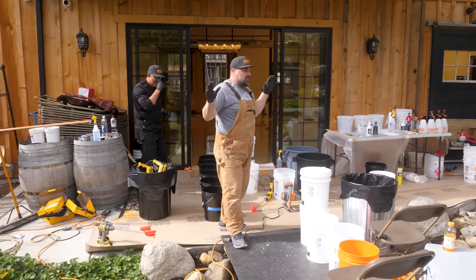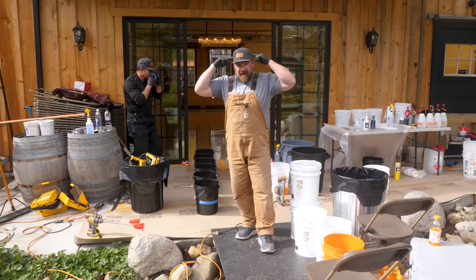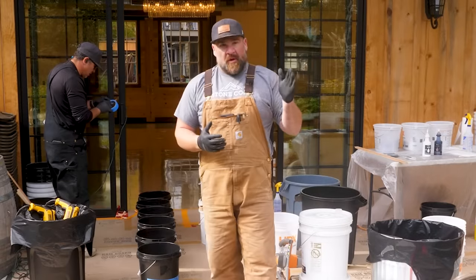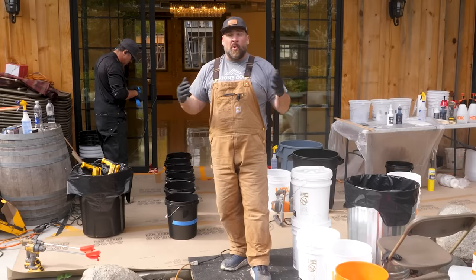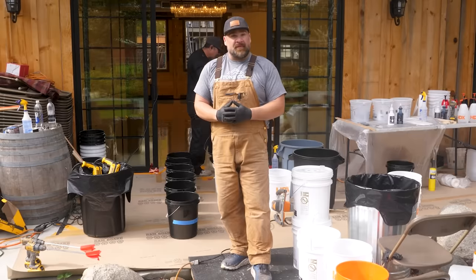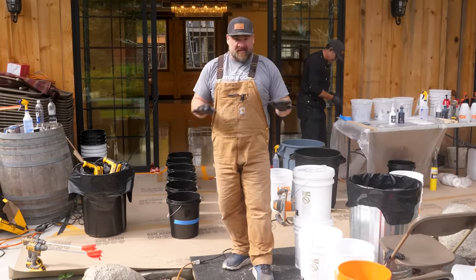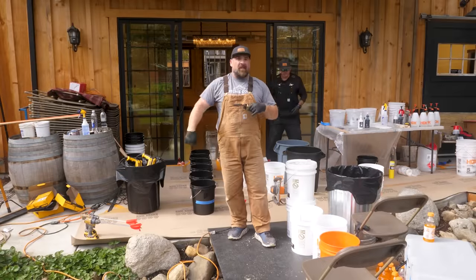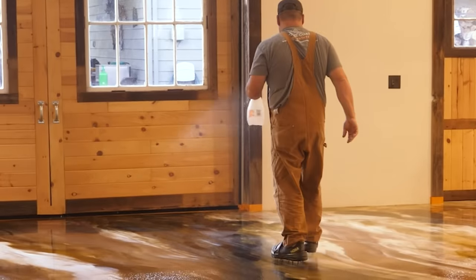We are pretty much prepped out. It's an important step to get your mind right and get everything organized, because once you start mixing up floor epoxy with this much material, you want it to go nice and smooth. You want to get it laid down as quickly as possible. With our floor epoxy, it is open and workable for a very long time — on the last 1,200 square foot floor I was able to walk on the first bit of epoxy I poured two hours later and it was still great. But we're going to work quick, get our ribbons poured out, then meld with rollers and magic trowels, getting rid of any air bubbles using 91% isopropyl alcohol.